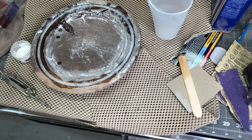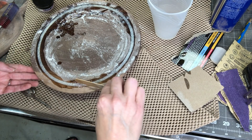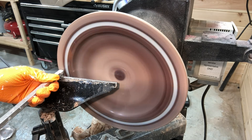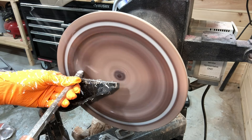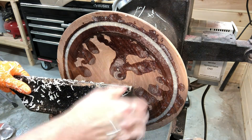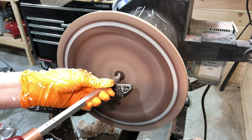Here I'm using a piece of cardboard to scrape around the rim, removing the excess and making sure it's flat before I pour in the resin, which I did not film. Here's a shot of after the resin's been poured in — I leave that overnight and then come back the next day and turn it. Here we are removing some of the resin; I use the carbide tool for this to make removing the resin a little easier. Even though I only poured resin in the recess with the mother of pearl inlay, it did overnight drip down into the bowl — more than I wanted — but it doesn't take much to remove it with the carbide tool.